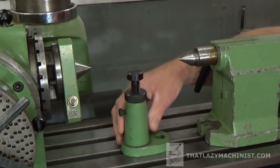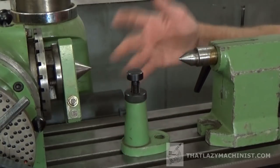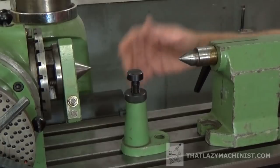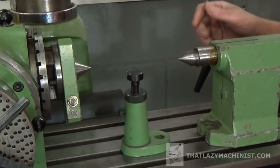That's why we can use the median support. All it does is absorb that downward force and transmit it directly to the table to lower vibration and to make sure that I don't get deflection on the part that I'm milling. So this is really only to be used with long and flexible parts. The anvil height can be adjusted, and different anvils can be used to adapt to different shapes of parts.